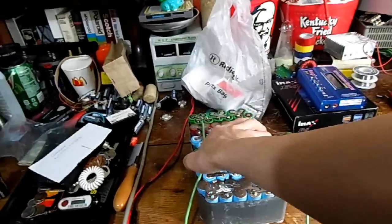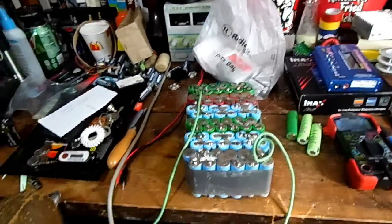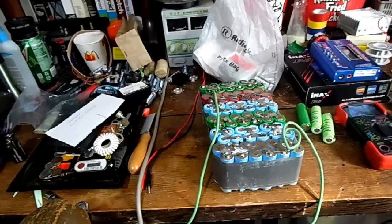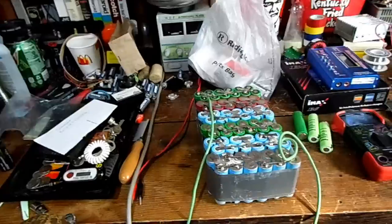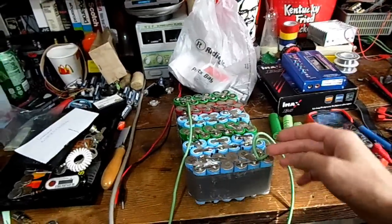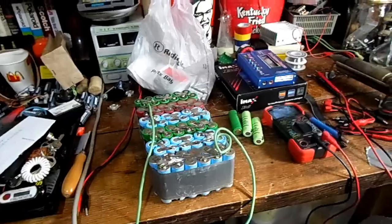This is my homemade battery pack for my electric bicycle. It is 24 volts at 35 amp hours. I plan to have two of these finished, but unfortunately last time I tested it out I had issues with balancing each of the cells or packs of cells in parallel, because some cells could get higher than others, and if that went on too much it could kill the cells.